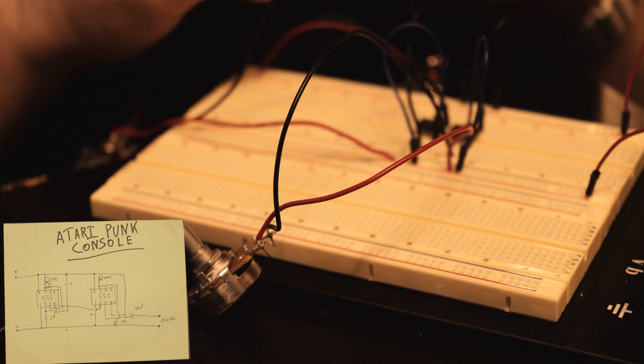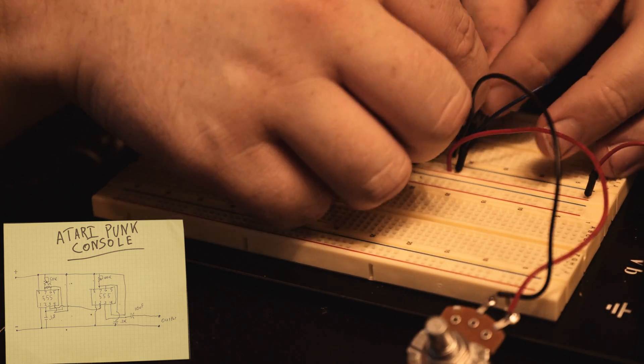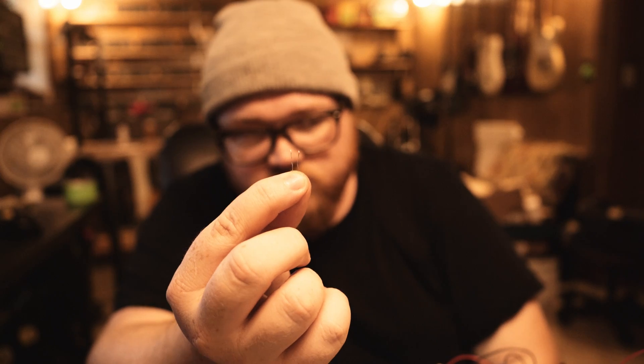In the diagram, on the first chip we're going to take the 7th pin and bring it down to the 6th pin using a 1k resistor. The legs on these are so short that it barely reaches the ground, so I'm just going to use a jumper to extend the legs.